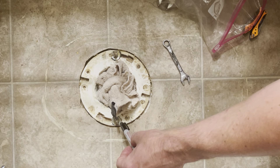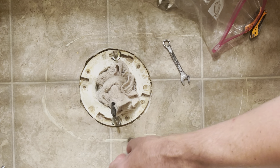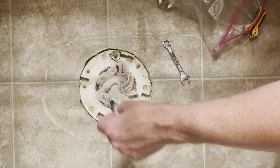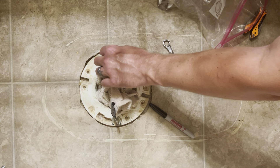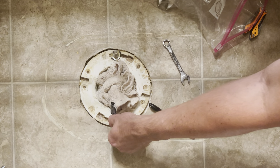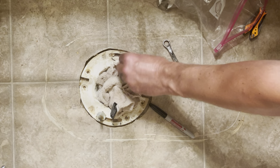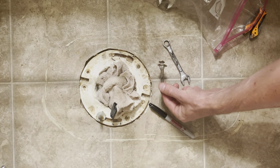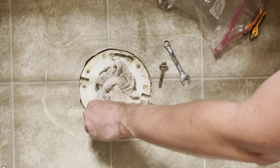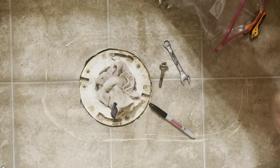The reason I made these marks is I'm assuming somebody has already leveled the existing toilet, and I know from doing this twice before that these marks are going to be acceptable for the gap for my tank back here on the wall. I've already backed these off, so I'm just going to loosen these a little bit — that's going to allow us to move them through the guide on each side and pull them out. We just spin them a little bit because they're rectangular in nature, so that allows them to be backed out. That one is out as well, so I'll throw that in the garbage.